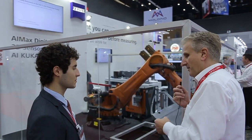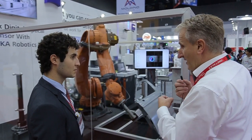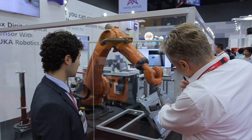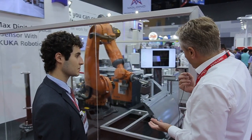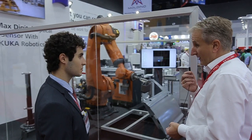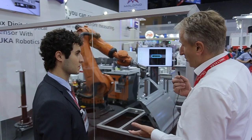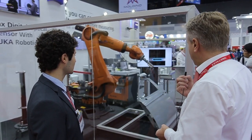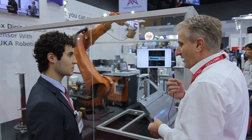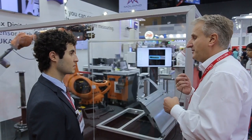The sensor has an accuracy of about 30 microns, but the robot has thermal drifts, and we can correct these thermal drifts with the help of measurement from a calibration pole, giving us much more accurate data for inline metrology. With this sensor we can measure holes, edges, studs — both long studs and small studs. We also have the capability to check the correctness of the geometry of rivets, most probably for aerospace but also for the car body industry. We are in discussion with car body producers to look for new features that can be checked that were not considered before.